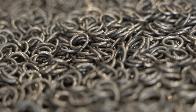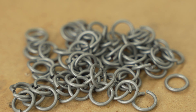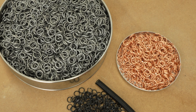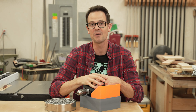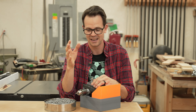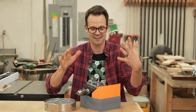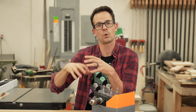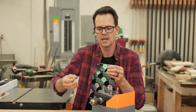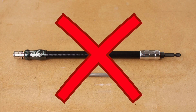And I mean thousands and thousands of rings a lot. I've tested thick steel and thin steel, copper and aluminum, different blades and all the things. So now I'm going to go through how it works and what I've learned, because it's been a couple of days and I've been going crazy making stuff and using this jig. I noticed I was having torque issues, not quite getting enough torque from my drill, so rigidly mounting it without that adapter really helped. You don't need that adapter I talked about earlier.